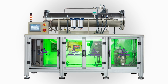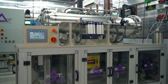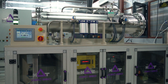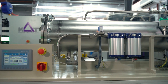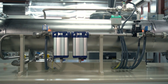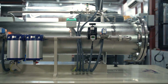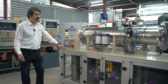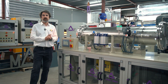Now we can have a close look at a bigger model. Right next to me we have a larger machine — a very interesting machine because this is not in our serial production; the size is completely customized. On this frame we usually apply 1000 grams of ozone per hour machines, but our client asked for the same body with 250 grams of ozone. So all the installation you see here is producing 250 grams of ozone, but with the same size it's possible to go up to one kilogram, and as you know from previous videos we can go up to 6.5 kilograms per hour.